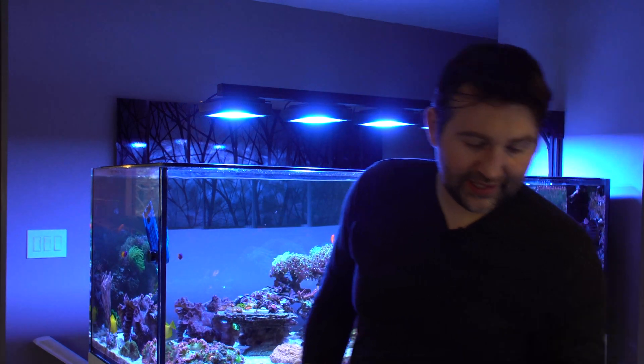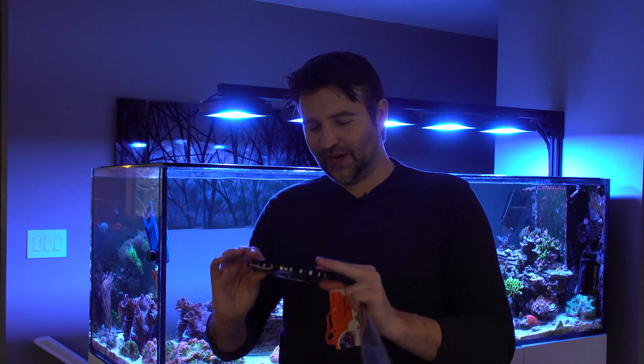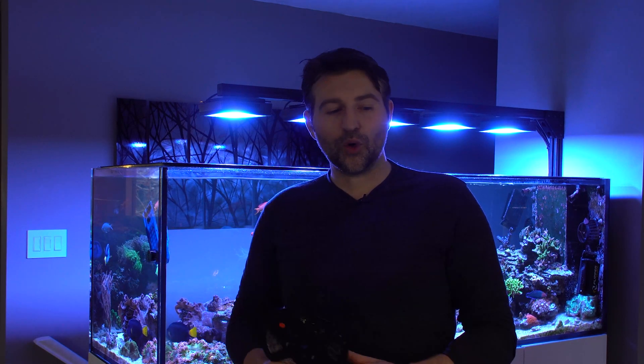What we're going to do is use the bare DC 24 volt cable. On the side of the Apex you've got those two 24 volt accessory ports you can use for pumps or solenoids and whatnot. I have one working for the ATO and there's another one that's free, so I figured I'm going to use that. I got the bare wire cable, and to pair up with it I got some 24 volt LEDs. We can power them directly off that port.